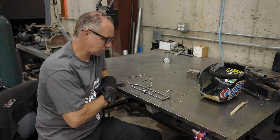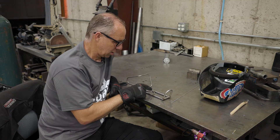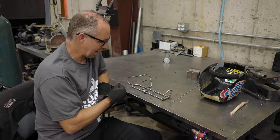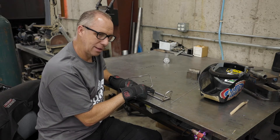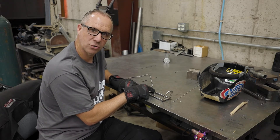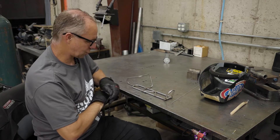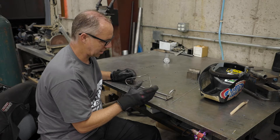One of the things you're going to get into welding titanium is it's extremely difficult. It's almost like welding a piece of paper with two magnets that are wanting to try and stick. You really have to focus on getting your rod into the puddle and getting it in and out. If you have it dance around or hang around, it'll want to stick to your part, and once you stick to your part, there's no pulling it back.